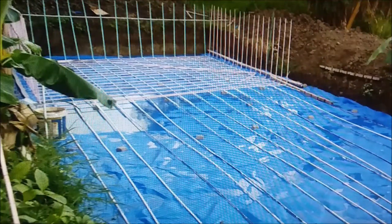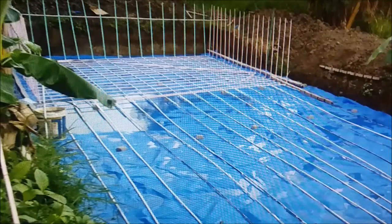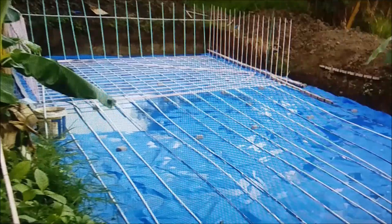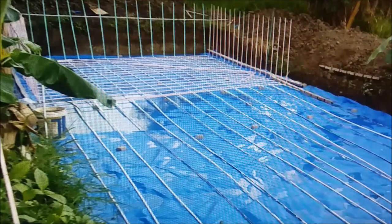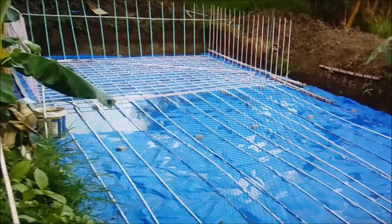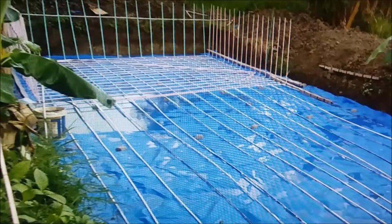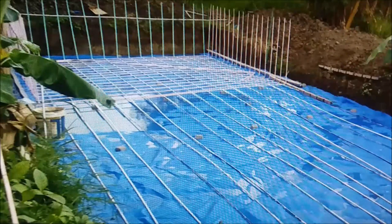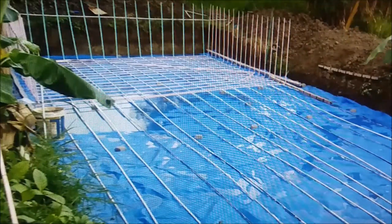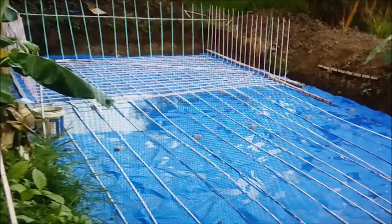The portland cement runs out, so your concrete is not as good. Also it changes the water content — bottom and top — and you get a lot of cracks in the cement that you would not normally have, even if you didn't water it and it wasn't windy and it wasn't 105 degrees out here. So if you put a piece of plastic down, you just keep what you mixed as what you mixed. It's cheap insurance. Also, not having the rough bottom means fewer stress points — it can run a crack from there. You'll notice that the grid is fairly neat, the bars laying out on the tarpaulin fabric.